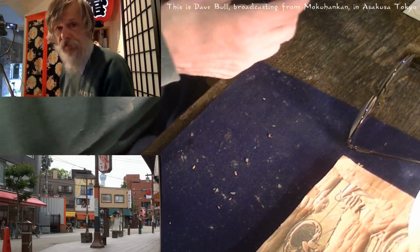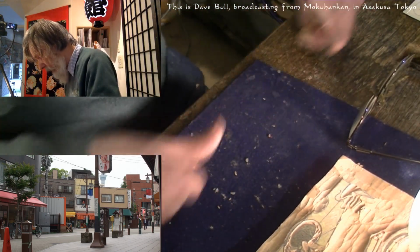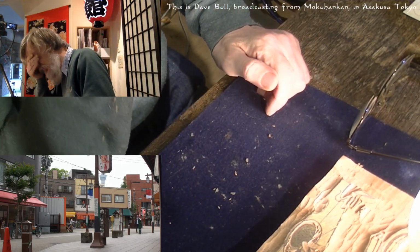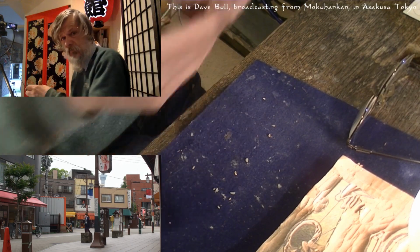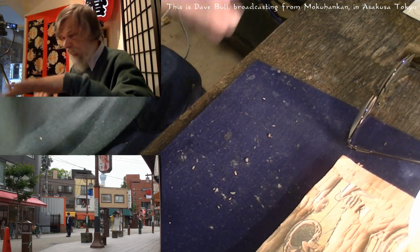they wear away really easy. So get your dowel with sandpaper, and in a few minutes you can make your first groove. Roll the dowel, roll the sandpaper. I guess you could figure something out with a drill, but you don't need to. They grind away so easily. Some strong sandpaper, a dowel, you've got your first groove. Don't think about making a groove as deep as what you just saw. You just want a groove a couple of millimeters deep, something to guide your chisel.